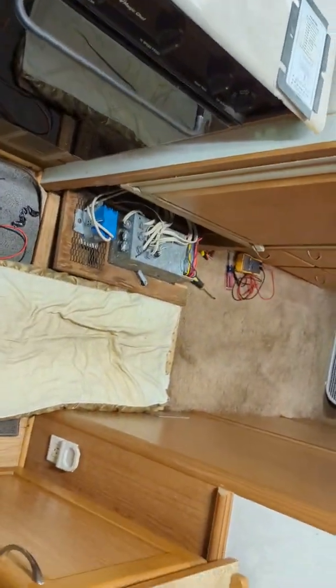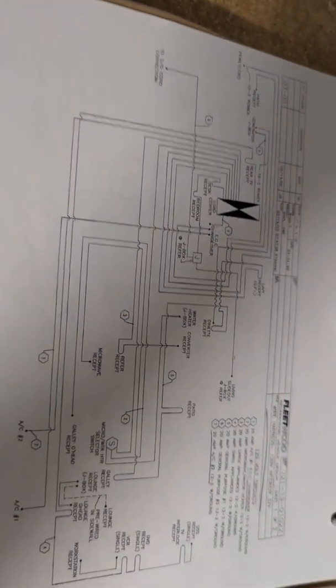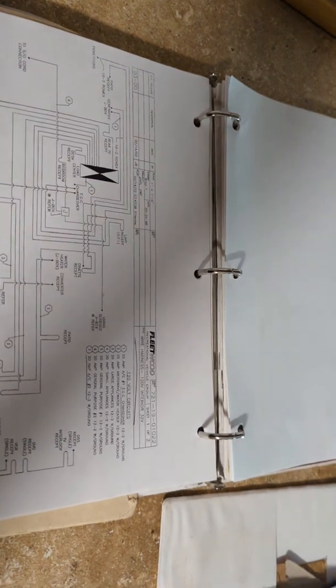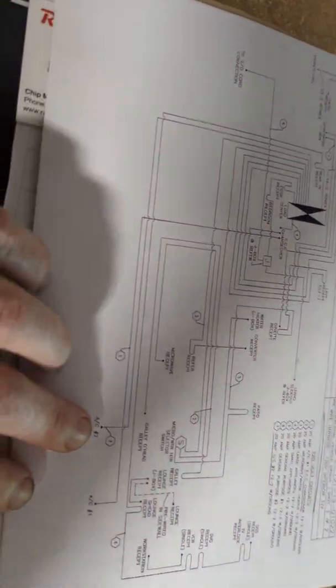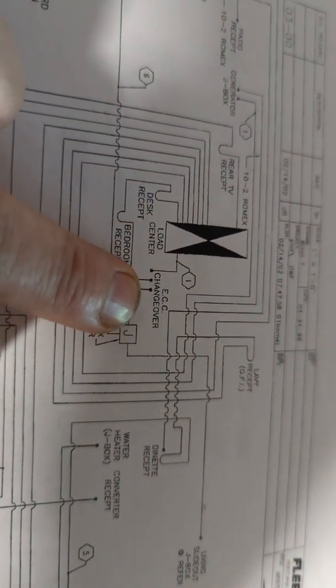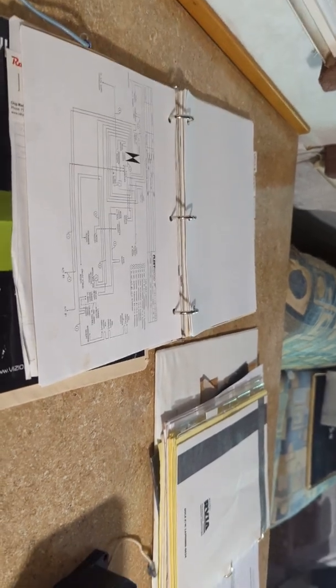That's a good explanation of how this system works. Now I just have to put the RV all the way back together. Here is one of the wiring diagrams — this is actually the good one because it shows the front AC. If you trace it back, it goes to the ECC changeover, which is the Intellitech module I just showed you, and you can also see it coming out of the circuit panel. Hopefully this helps you get your RV fixed and back down the road. Thanks for watching.